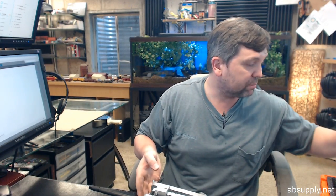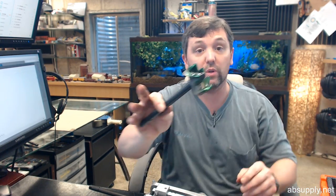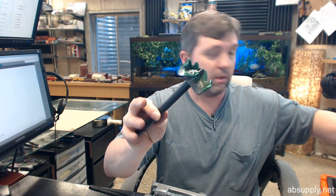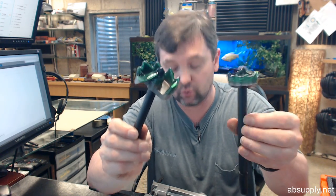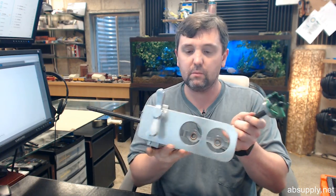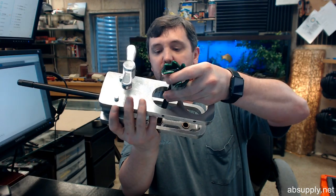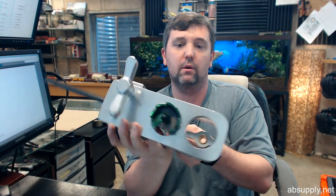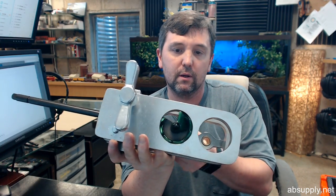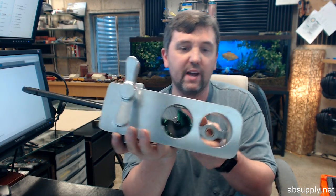Then you're going to bring your spade bit. I will grab the 2 1/8. That's obviously just green wax that's on there, and you peel it off, and then your 2.5 as well. So you will then load that tool down through whatever hole. We'll just do the first one. I think that's going to be the 2 3/8 and 2 3/4 prep. Okay, we're able to fit that through there even with the wax on.